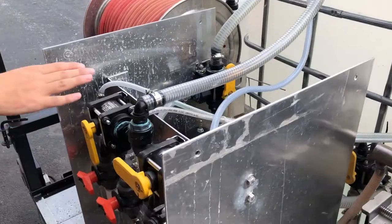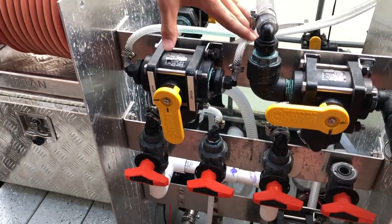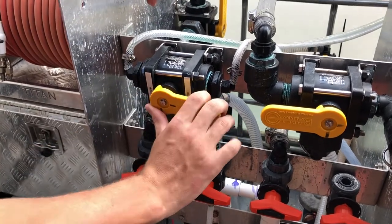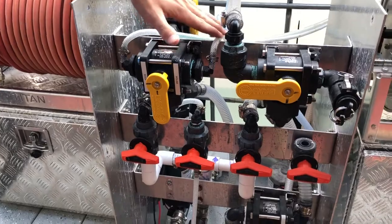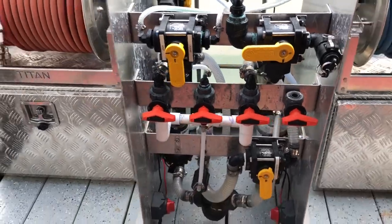On the metering system we have a 3-way valve. One side comes from our roof tank — it's just a direct line off the top. The other side comes from a T-valve with both house wash chemical tanks hooked up. We can select which one we want, and on the house wash side we can open and close those micro ball valves to select which tank we're pulling from. There's a more detailed video on our metering system if you want more information.